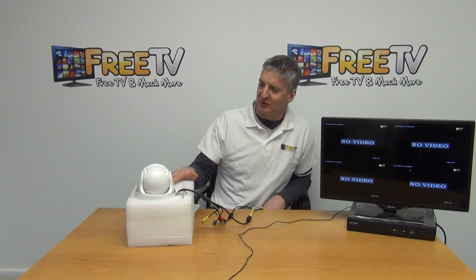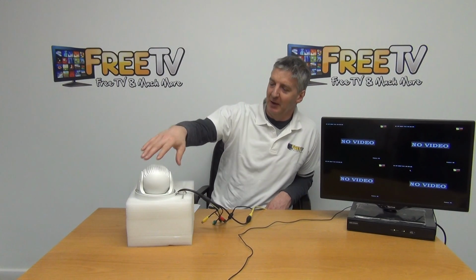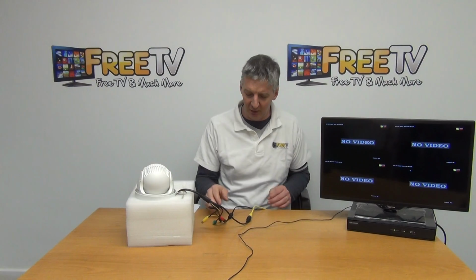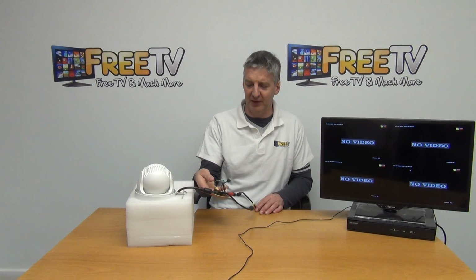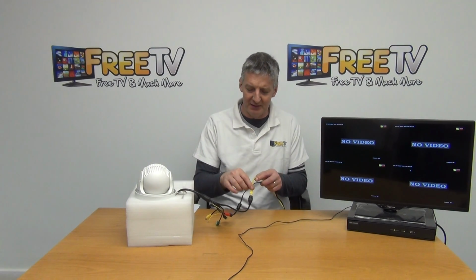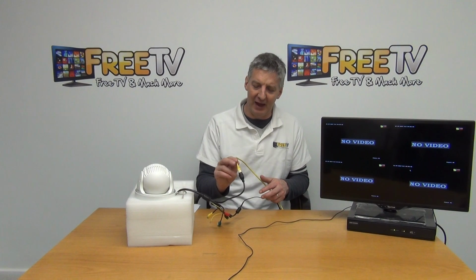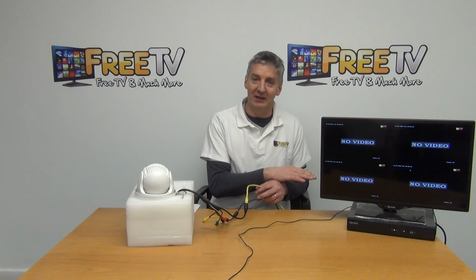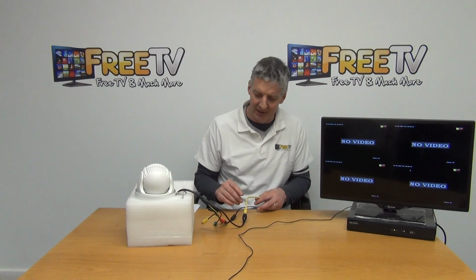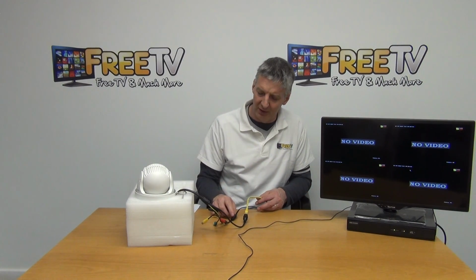And then what we've done here is just mounted this camera. It'll actually be upside down when we see the images in a few minutes time, but we just put this into its base to allow it to tilt and zoom, all the rest of it. We have this whole combination of cables coming out here, but we'll note we only have two cables connected. For both the picture and the control element, we have the patch lead here that goes directly into the back of our Hikvision DVR, through the single RJ45 connection, a LAN port.